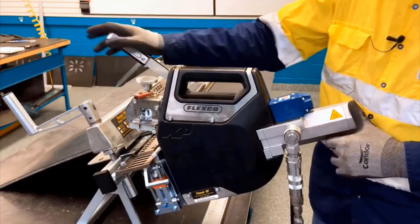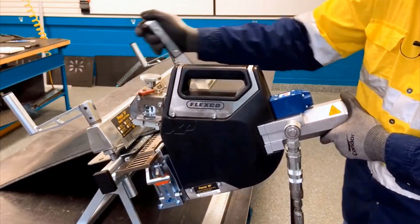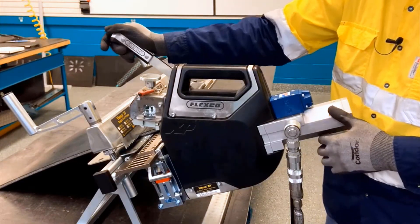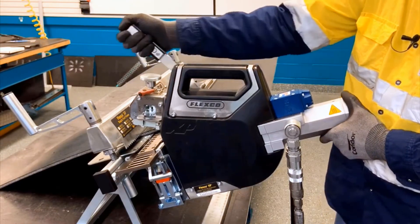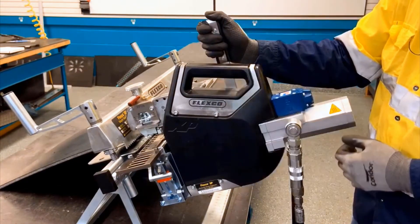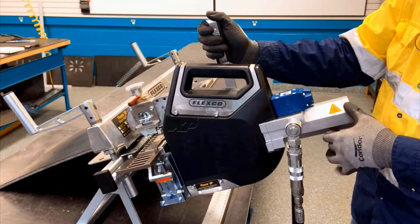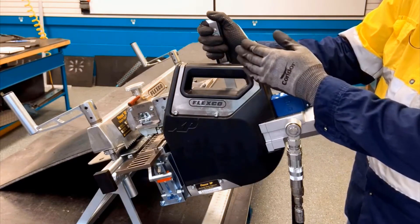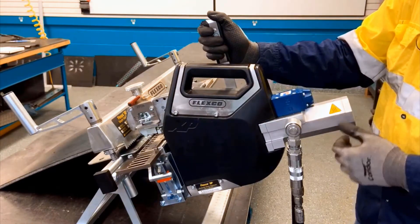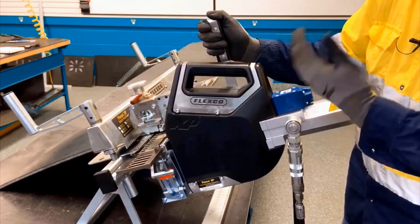The tool can be advanced by doing a quick advance, which is moving the handle partially without actuating the hydraulics. The fully cycled tool will bring the handle all the way back, allowing it to cycle fully. You'll know that it's done cycling because the tool provides feedback in the handle — the handle will jerk forward, telling you that it's fully cycled.